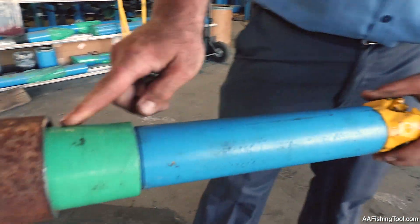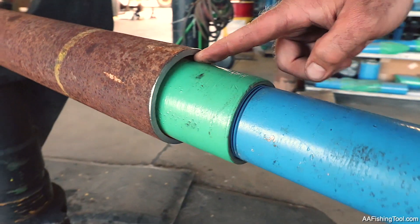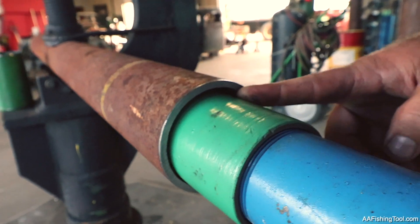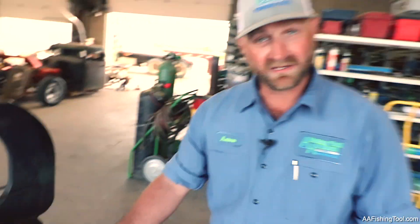As you can see with a turn-down coupling, there is very little room for you to push water by to drill with, and you about have to go the long way on a situation like this so you don't get stuck in a hole and have cuttings wedge you.